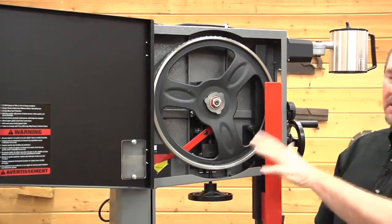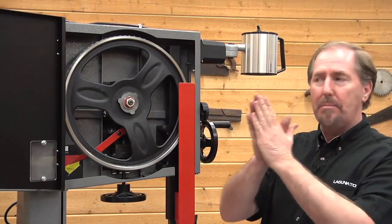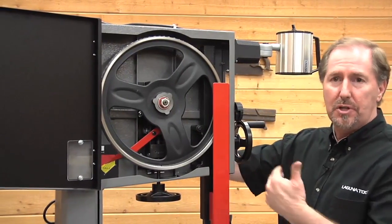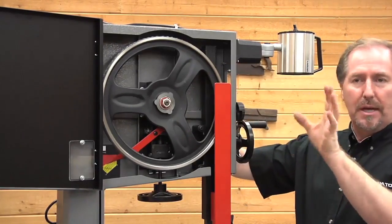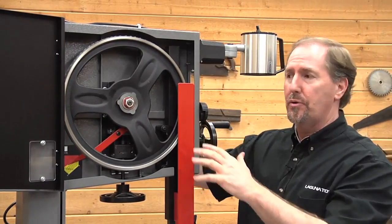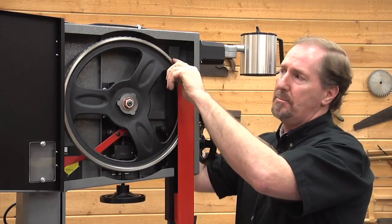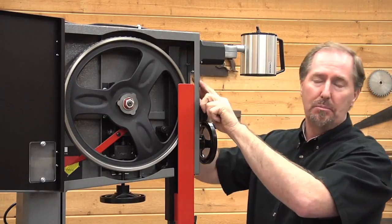While covering blade installation — we've set the tension. The next step is to set the tracking. Tracking is the position of the blade forward and back as it sits on the wheel of the bandsaw. There's a knob on the back called the tracking knob. With the saw unplugged and power off, rotate the blade and see how it's laying on the wheels. It may move a little bit. On an initial setup, you may have to take the tension off slightly to make some coarse adjustments to keep the blade somewhat centered. I notice my blade is riding a little bit toward the back, which I can see through the opening here and through the tracking window on the side.